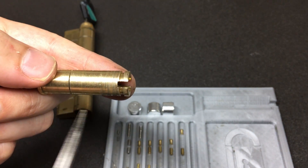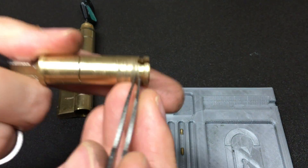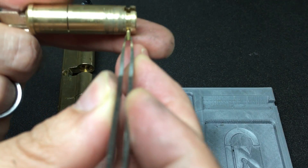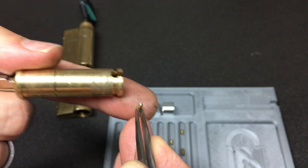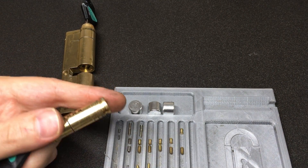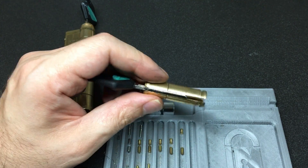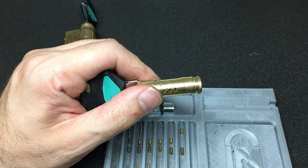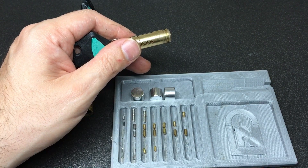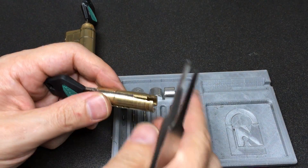Here is the tailpiece of the lock. I probably could have slid a shim in from the front once I got it out so far, but I didn't. That area where the circlip goes on is definitely wide enough for one of these trap pins to engage - which it did. Luckily they have rounded tips, and a couple of quick thwacks on the back of the lock with a plastic-handled screwdriver meant I could bounce the pins out. But I did damage one spring when I withdrew the lock, which is a bit of a shame - though I think it's recoverable.